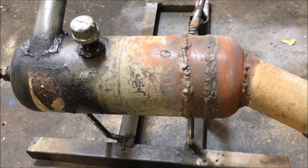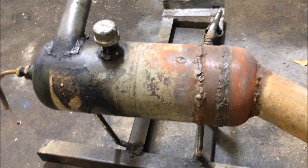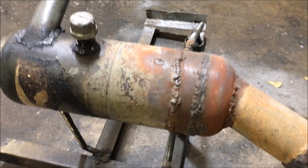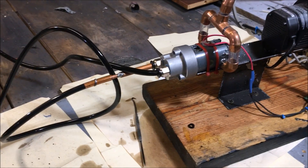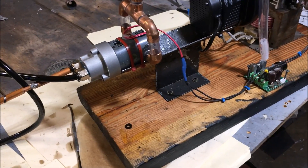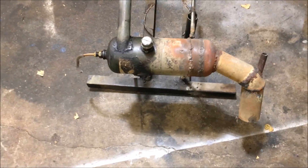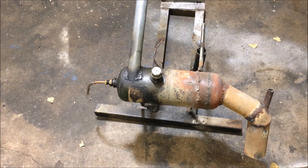The vaporization coil also didn't go very well — it was clogging up. It could have been that my filter was clogged; I haven't got to the bottom of that yet. When I took this pump apart, the inlet port was completely clogged despite the fact that I had filtered the oil. The substances that clogged up the system were a very small, hair-like material. So I haven't yet figured out whether the vaporization coil was okay and it was just the pump that was clogged, but either way I want to go ahead and try a spray nozzle, just like in an old furnace.